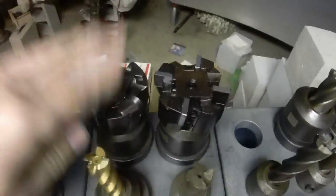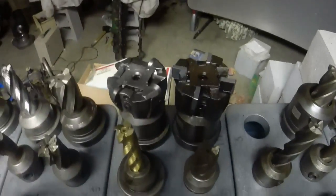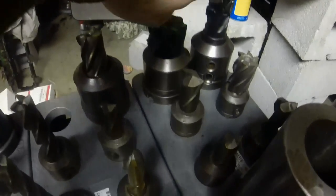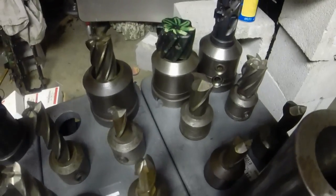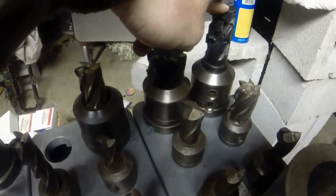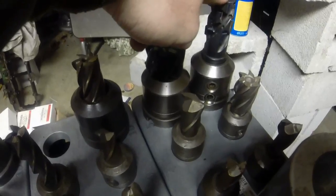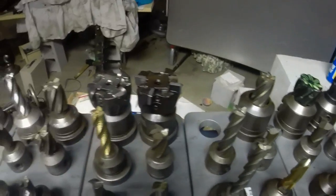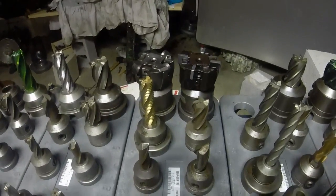I've got all my drill section and my end mills organized by size. Those are my favorite Lovejoy cutters there, and a kind of metal side mill there — that's a good cutter too. I like it because I've got several of these in my regular 50 series that all use the same inserts, so I always try and keep stuff that uses the same inserts so I don't have to buy a bunch of different styles.